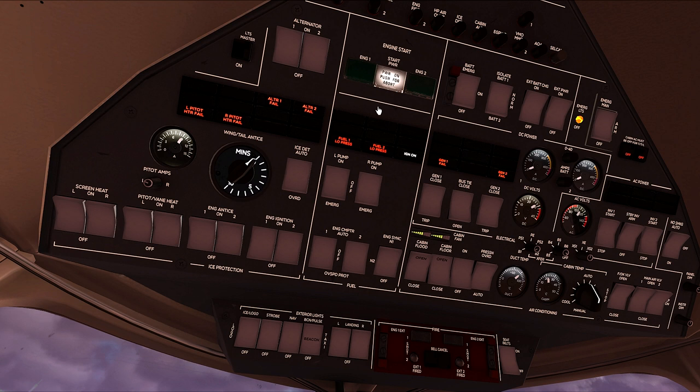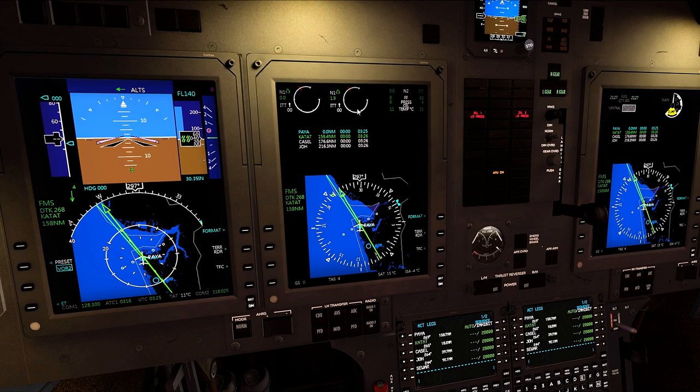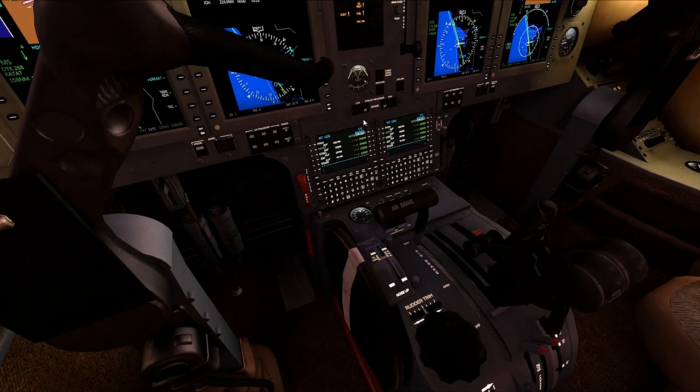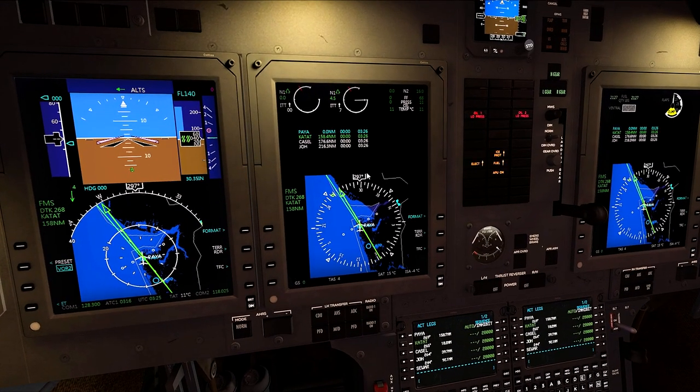And we're going to add the start power. What we're going to do is start the engine starter. We're going to look for N1 rotation. I see it. We're going to come down here, cut on our fuel, and then go back up here and monitor oil pressure, ITT, N1 rotation, looking for a light, seeing the oil pressure indication, low oil pressure.